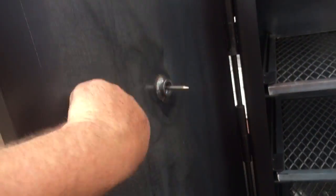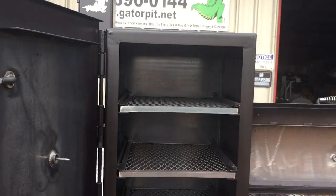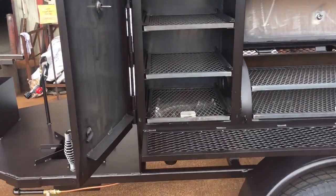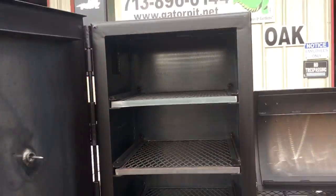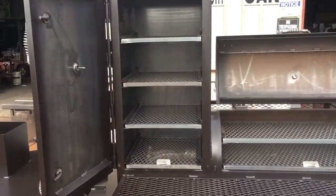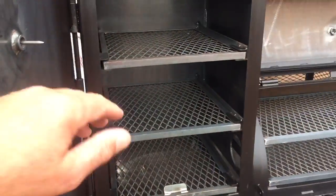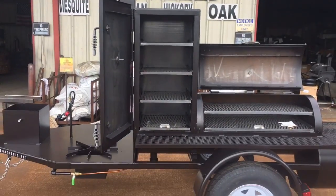The upright itself is quarter inch thick steel. I say that because a lot of the other makers out there make them out of 3/16th or eighth inch plate — a lot thinner steel. We go quarter inch. Why? Because this is the coolest section of your cooker, typically. And if you go with thinner steel, it's going to be really cold over there. So we make it quarter inch so you get a lot of heat retention. Gets you some temperatures up there where you can cook in that thing, and not just use it as a warmer.